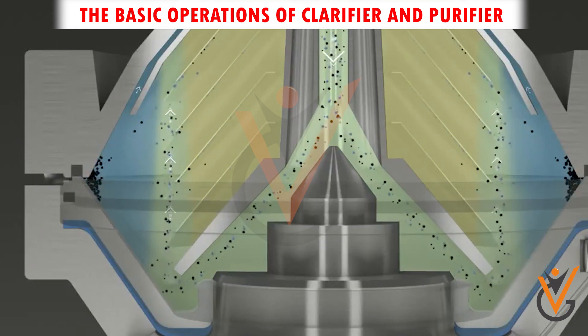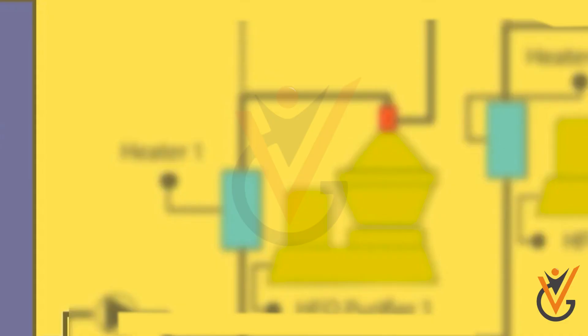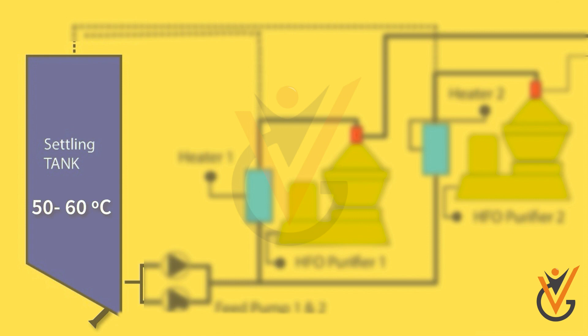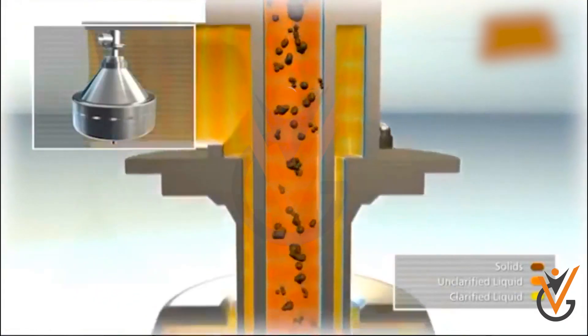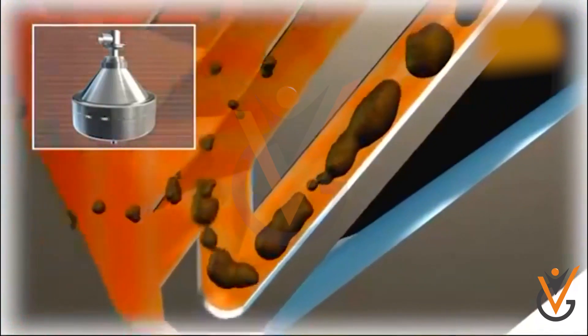In a clarifier, there is no heavy liquid outlet for discharging separated water, hence water sealing is unnecessary. Feed rate and temperature of the feed are extremely important for purification. For normal oil, one-stage purification is enough, but for oil containing heavy sludge or catalyst mixture, multiple purifiers are used in either parallel or series to get better results.